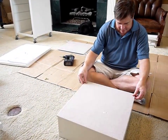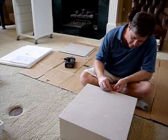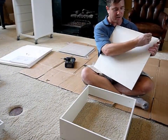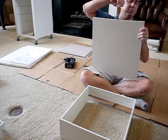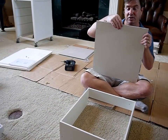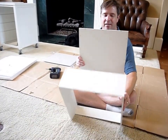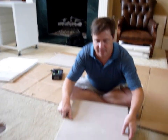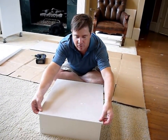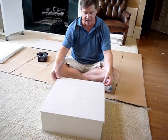It's a little bit tricky because you can't see through it. So you actually are literally poking through that hole. The screw holes are big enough to accommodate the screw here, and then they're just pre-drilled down there, right? So you're pushing through that felt, and the felt will help it line up, but it also kind of blocks your vision so you can't see what you're going into. To complicate matters a little bit more, you might have to move it. The way it lines up is pretty flush front and back, more or less flush, but the sides overhang a little bit. So I've got a tip of my finger on both sides, and that should line it up right.